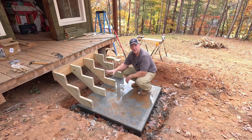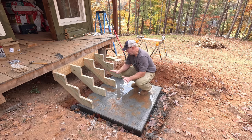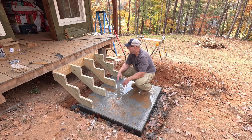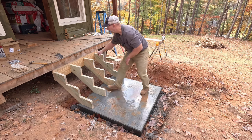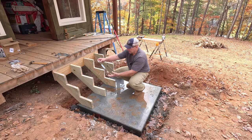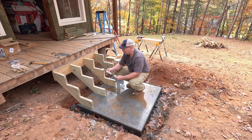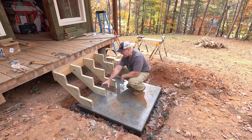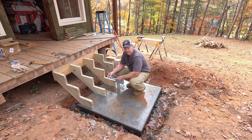I just put my stringers up here to dry fit them into place, and they look great — I couldn't be happier with them. They all sit relatively plumb and flush with the lines that I have drawn. I have stringer brackets here that are going to go up against that rim joist extension, folded up underneath to support the stringers from below. I've got to cut the notch in the front of the stringer at the bottom for the two-by-four that's going to be bolted into the concrete landing. Then it might be time to attach the stringers onto the board.